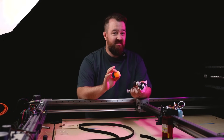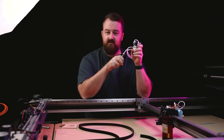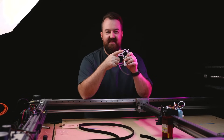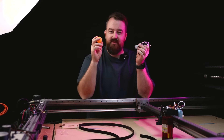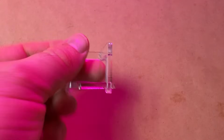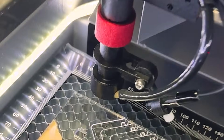I learned a lot going through this process. Initially I just tried it with the vacuum pump, but even though it would suck the ball up, when you turned the pump off it didn't release the back pressure — it just stayed suctioned to the ping pong ball. That's when I realized it was really important to add that extra solenoid valve to release the back pressure and drop the ball. I then wrote a small program to pass three balls around five different areas. For the stands, I created little acrylic stands with a three-point contact — perfect for sphere objects.